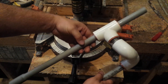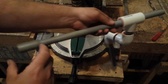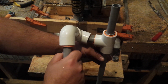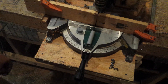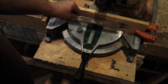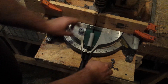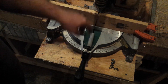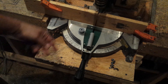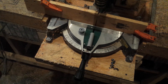All the bearings are done. I'm gonna put an end cap on here with a screw on it and I'm gonna make a weighted piece that slides in there to make sure that when you're holding it up it'll sit upright. To make the base plate that'll hold the weights I've got an angle piece of aluminum with three holes drilled in it and a base piece of PVC pipe. I've got some bolts - I'm gonna put a bolt through the middle hole, put a wing nut on that, and put one bolt through each of the other holes going up. I'll put some weights in there and secure it all with wing nuts.